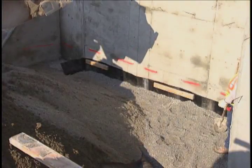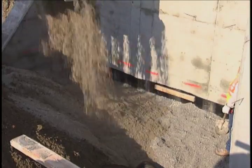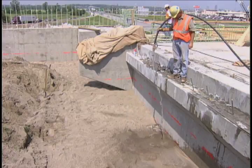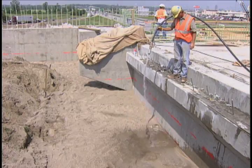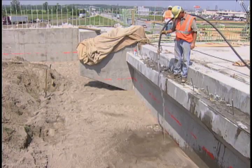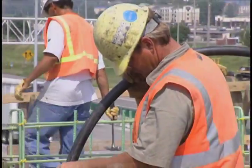Finally, porous sand is placed on top of the gravel in 2-foot lifts, then flooded with water, beginning at the downward slope and proceeding upward. The key to this process is the permeability of the sand. The faster the water is able to flow into the drainage layer and out the sub-drain, the better the consolidation of the materials.